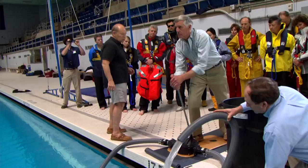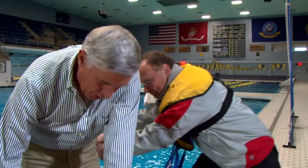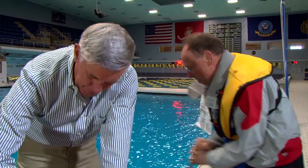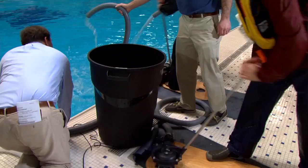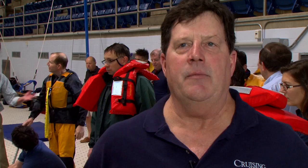You can't have a pump that's too big — when you need it, you need it, and when you need to move water out of your boat, you need to move it quickly. The bilge pump alarm is going to let you know that you have a problem; you've got to get down there, find your leak, plug it or stem the flow, and get it to the point where you can keep up with it with your pumps if you want to get home without calling the Coast Guard. Make sure you have multiple pumps on board — the electric pump buys you time, but you need the manual pump if your batteries flood or go dead. Like everything else on a boat, redundancy is a very good thing. The more you think about how you're going to work the pump, get to it, and clear it if it gets clogged — while you're safe at the dock — the more ready you'll be when you're out on the ocean and run into trouble. Be safe out there.